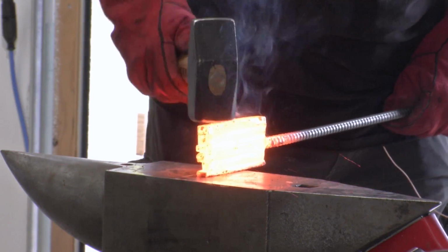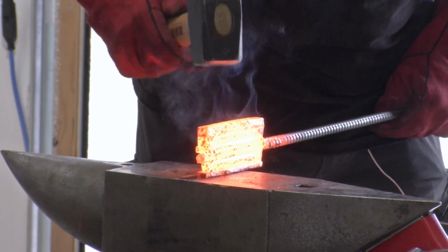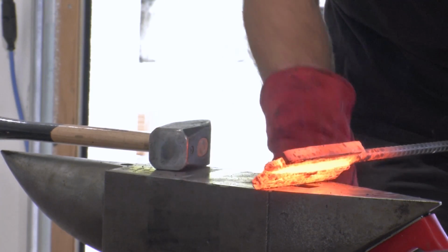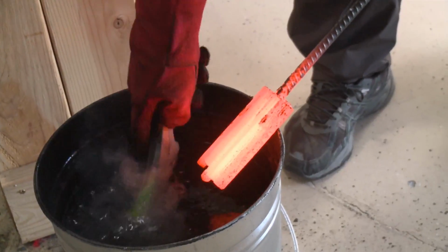As I said, I'm just going to set this thing ever so gently. A little bit more pressure now, a little bit more pressure now. And stop. Don't go farther than that. See how the anvil pulled heat out of the bottom one? I'm going to turn it over to do the other side. And now I'm going to wire brush. That water helps to pop this stuff off.